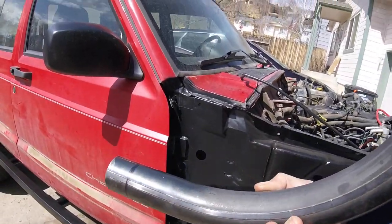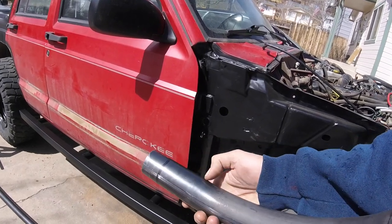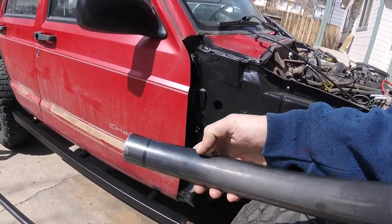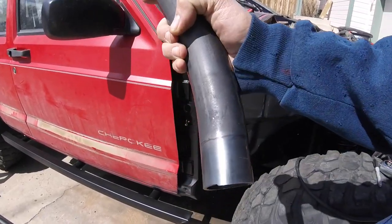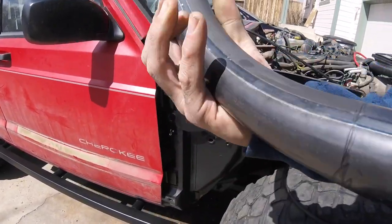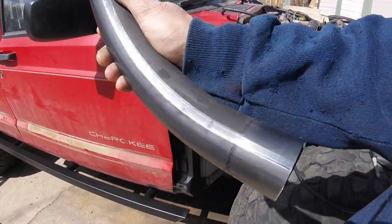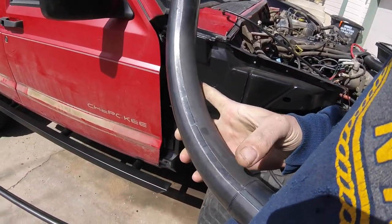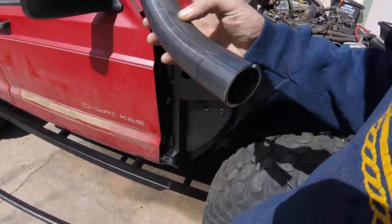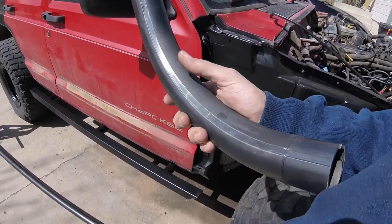But I made this that shows the start of the die and the actual start of the bend, and then the end of the bend. So I know, because I marked it out, how many inches of material that was using. Got 12 inches right here, so about 13 inches of material to make that, and then I can calculate 6.5 inches, etc.